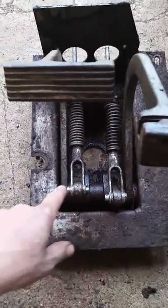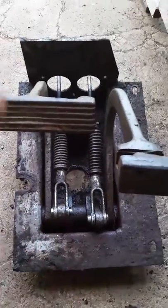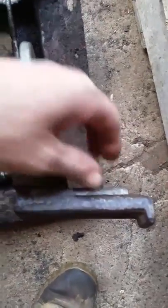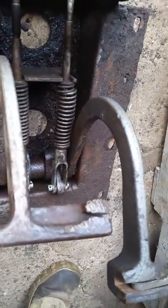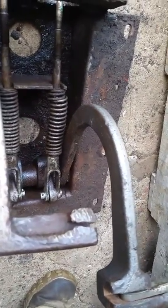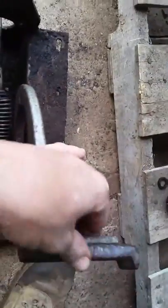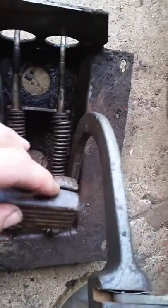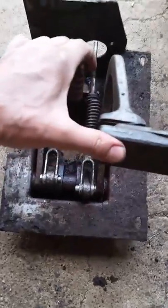These things here — this bar right here is froze up. I don't know if it's been like that for a while, but I just bought this tractor and it looks like somebody has been using a hammer or a pipe wrench to move these brakes for a while. You can see right there they got it all beat up. You can't even get the thing that puts your brakes together to work as one — you can't even get that in the slot. This thing just doesn't move.